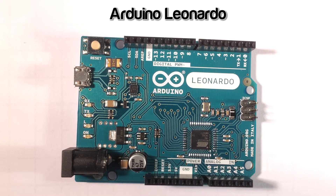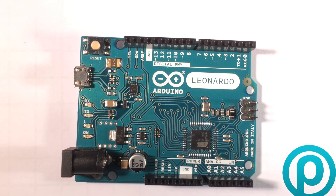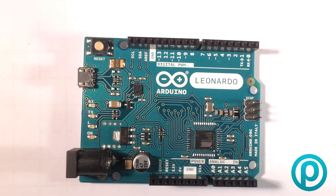Welcome to the Pain Tech bite-sized reviews — this one for the Arduino Leonardo. It's a 16 megahertz chip, a slightly different form factor to the UNO but actually quite different in several ways. In particular, it has a very different chip on board: the ATmega32U4, instead of the ATmega328 found on the UNO.